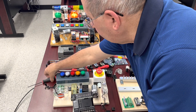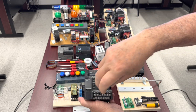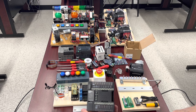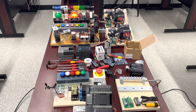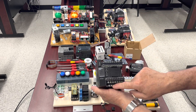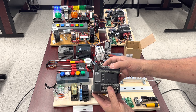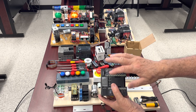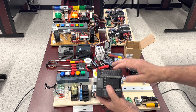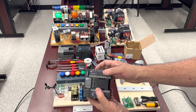And there's even more: you can use a square number zero, which is a Robertson, and this one is also going to work fine on our PLC. So from that perspective, talking about wiring flexibility, this may become a very interesting point for beginners — you can use a variety of tools on the terminal blocks, which are, by the way, very sturdy and very solid. This one looks sturdier and better made for beginners.